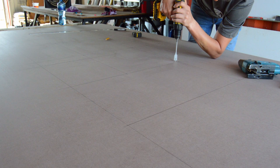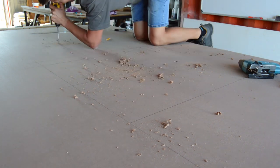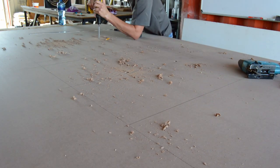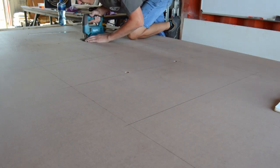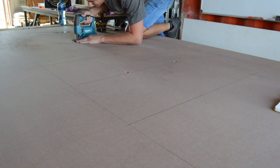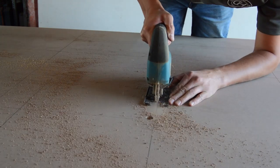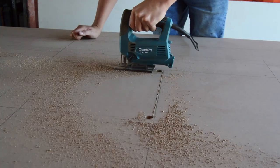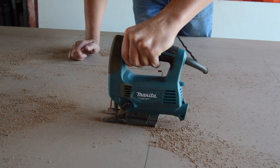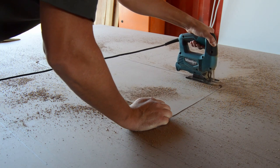Now we're going to start by cutting a big hole in the center of the MDF sheet where my TV bracket is going to be fastened against the wall. I'll start by drilling four holes in the TV bracket area with a spade bit — just so my jigsaw blade can go inside and I can cut out the square easily. When cutting with the jigsaw I'm cutting freehand, making sure I cut next to the line rather than exactly on it.